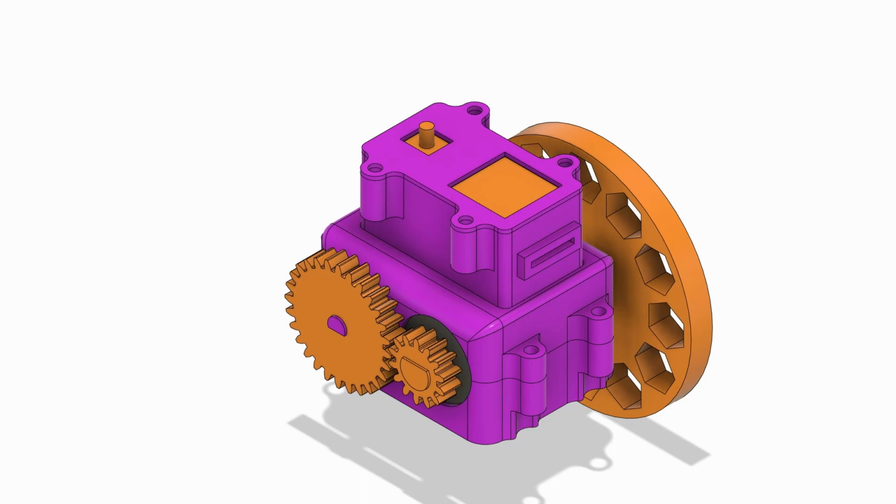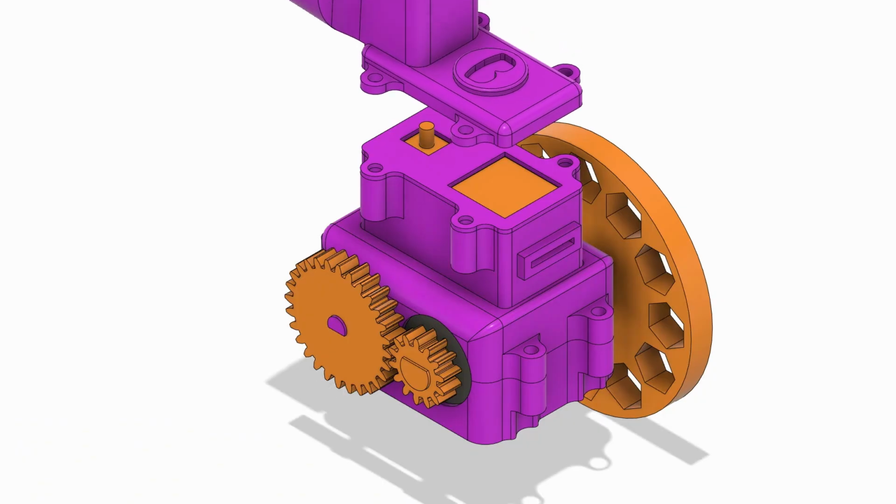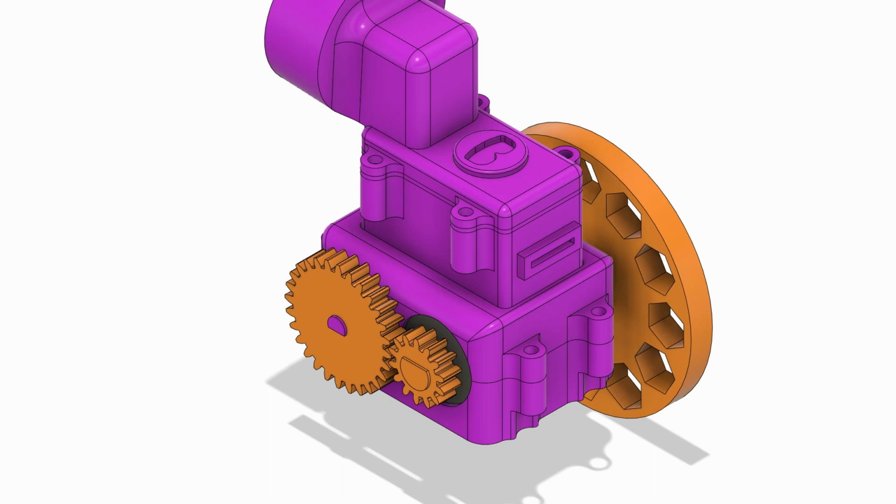After this, the cylinder head has a recess in here for an O-ring and the 6mm ball bearing. Then the cylinder head is bolted onto the jug with this gasket snug underneath. If you got through all of that without clicking off, thank you so much. Now, on to the test.